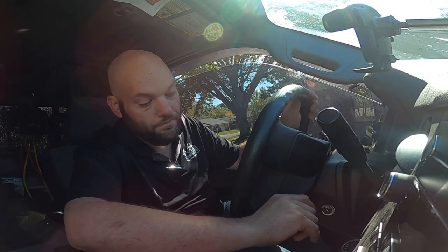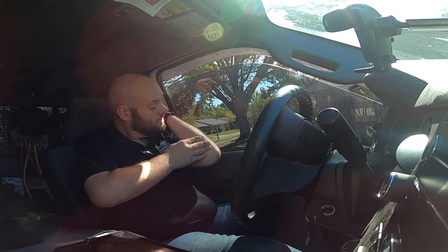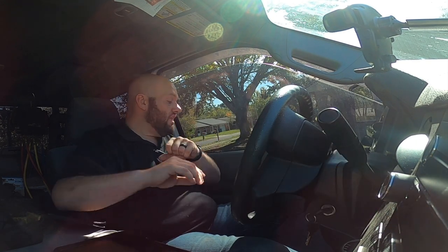All right, guys, so I'm not afraid to say that that one threw me for a loop. There's some fiberglass on them old units and it got me. I have not done a shaft up motor in a cradle in a really long time. So it threw me for a loop when I went to put the new blade on. I put the new blade on like normal, you know, when you would flip it upside down. But when you flip it upside down, the bends are facing up and I'm like, something just didn't look right.